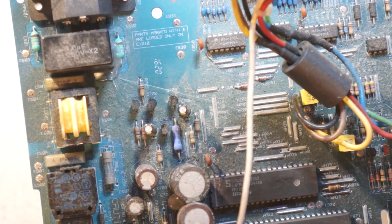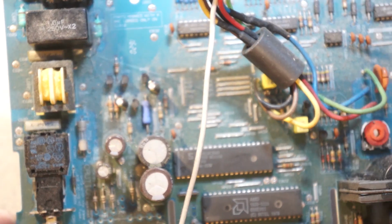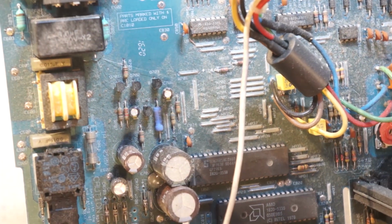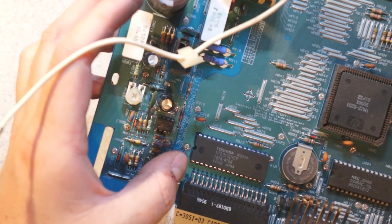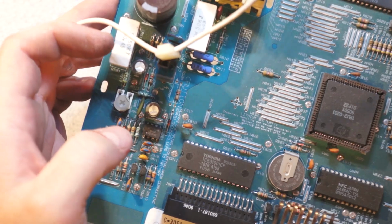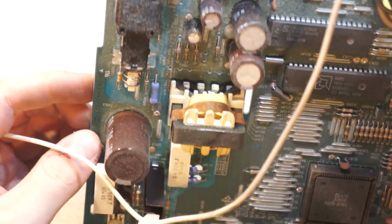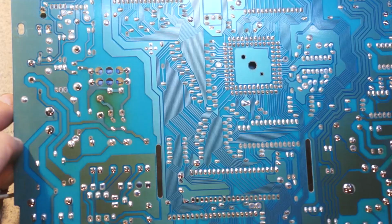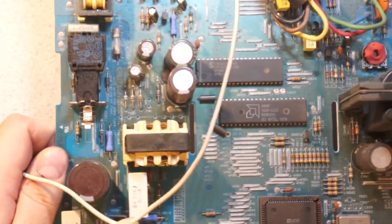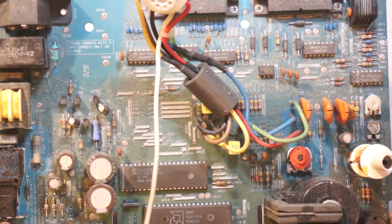Actually, the reason that doesn't look to be plated through-hole is because this board is double-sided but is not plated through-hole. That's quite intriguing. It looks like there are a few places where they use a metal insert to make connectivity between the two sides, but it appears this board is 2 layers with only a single signal layer. The bottom side is their signal layer, basically, and the top side looks to be a big ground plane. This thing is really cost optimized, I guess.